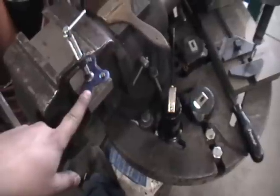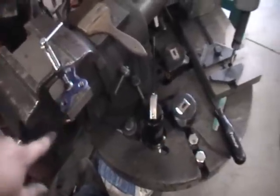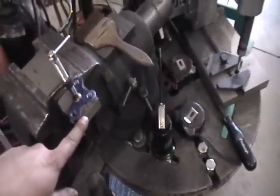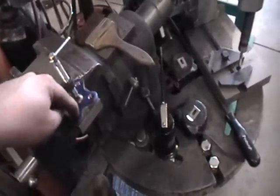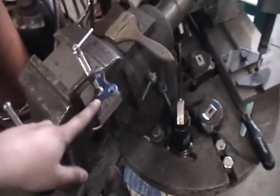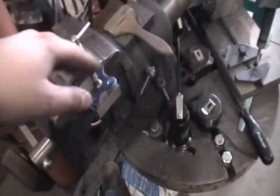The two uprights use three quarter by two inch solid stock and are going to be drilled to match up with our forward control bosses. I've got one in the vise — what I did was take a forward control boss that would be welded to the frame and clamped it onto a piece of the stock. All we'll do to get the position is transfer punch the three holes, put it in the mill, level everything up, and drill the three holes. Once that's done on both right and left, we'll jig everything up together and weld it.